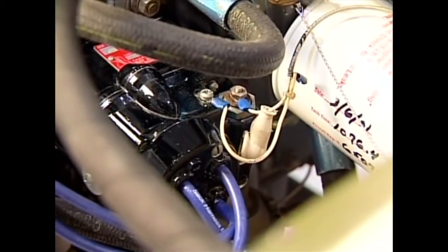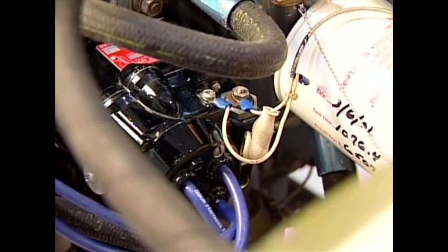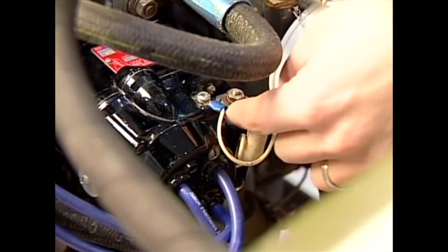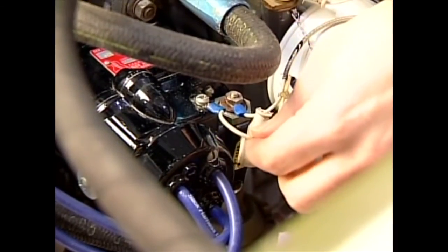The exterior of each magneto and the quality of the wire attachments are inspected for defects. Magnetos have two types of wires attached to them: ignition switch wires, or P-leads, and ignition wires. The P-lead is a single shielded wire that comes directly from the ignition switch in the cockpit to each magneto. The purpose of the P-lead is to disable the magneto.